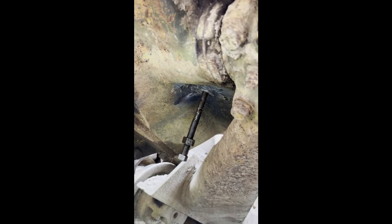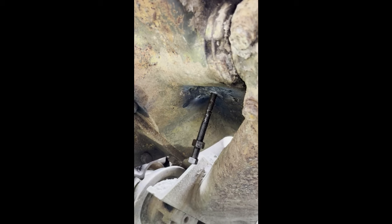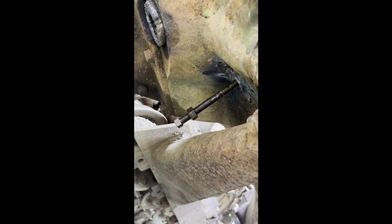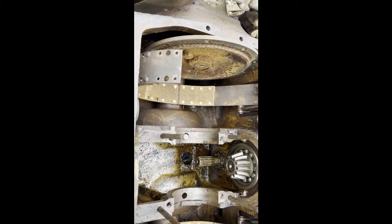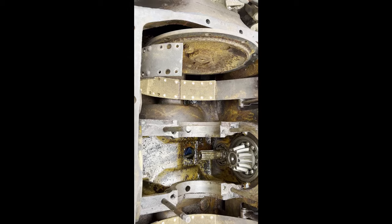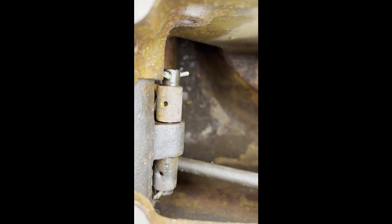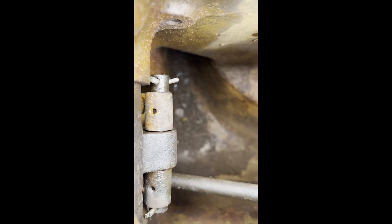I'm underneath the army cat here now, and it was quite a bit of a wrestling match — heating it and cooling it and extracting that very long brake adjusting bolt with jam nuts on both sides. They're both in pretty bad shape, but I got them well oiled and worked and they're going to do the job for another few years. Looking in over the top, I got the bands broke apart again, got the top section pulled off of both bands, and both slid in. We got them pinned and oiled, lubricated a little bit, well oiled with cotter pins installed on both sides.